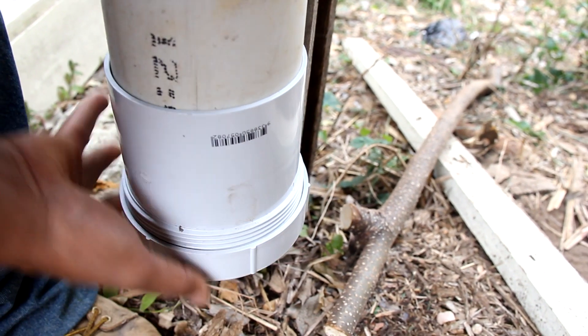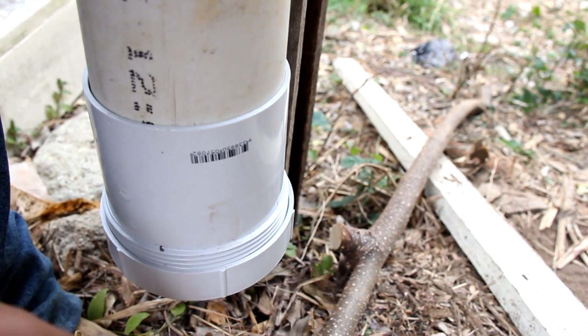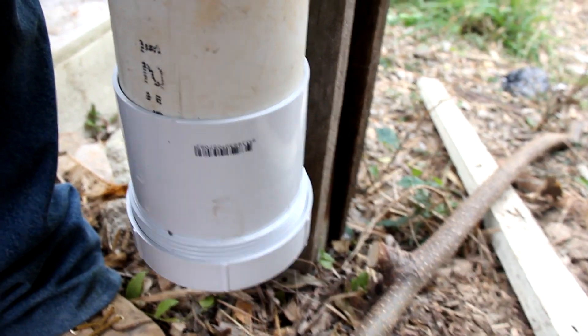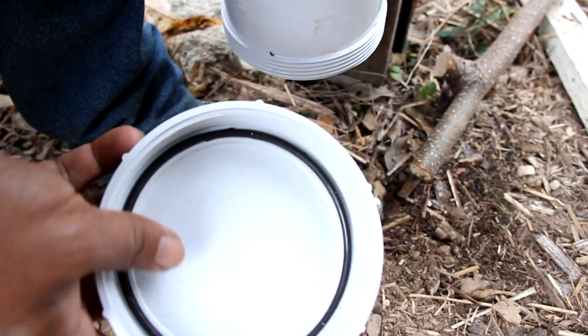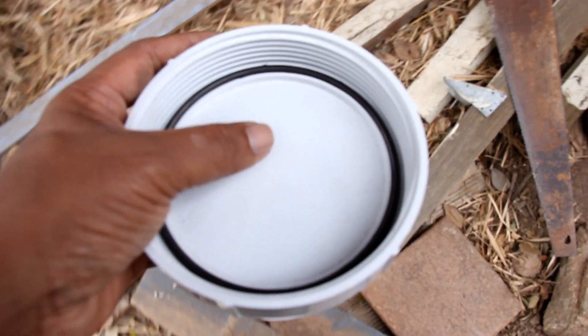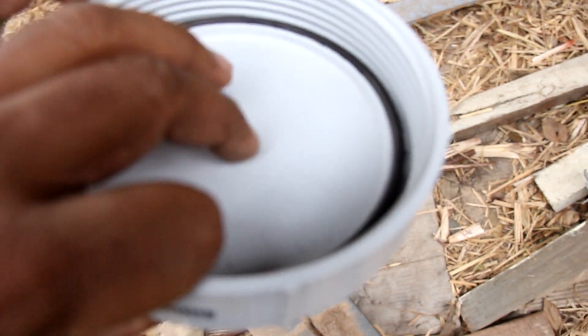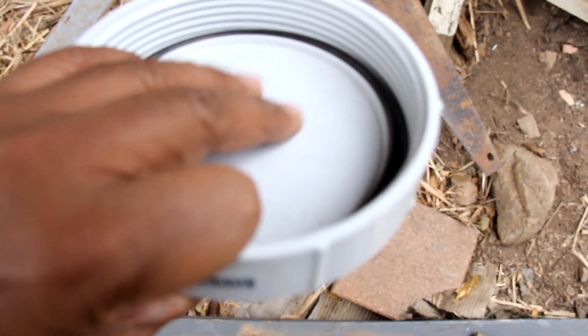Now when I do this up I'm going to have to test it and just make sure — I'll probably just do a little marking and see exactly where I need to tighten it to so that it just seeps a little bit of water out. A normal off-the-shelf kit has a little weeper in the bottom so that it all just trickles out. I have seen some people just drill a little 5mm or 3mm hole just to start, with the hole on the bottom, just make sure there is enough flow that the water will trickle out — you don't want water sitting in there stagnating. It should be enough that even a little bit of the silt drops through as well. Then every couple of rains all you have to do is unscrew the cap from the base and just let all the larger muck fall out, and just clean out the pipe and give it a hose out — and that's it.